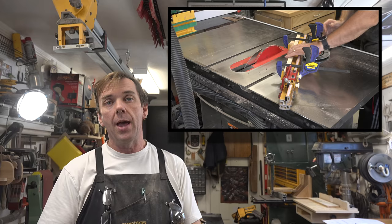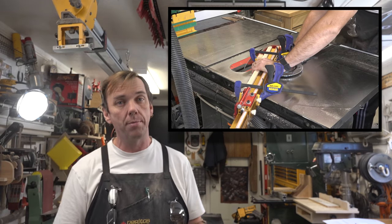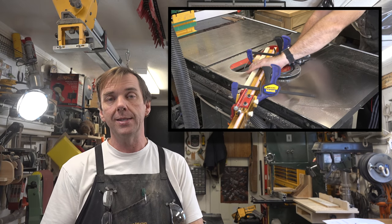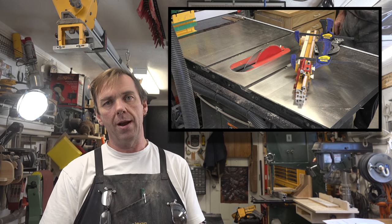Before you can mount these leaf springs, there's one more thing — remember that angle at the back. Earlier I said it wasn't necessary to cut it yet; we'd cut it later to make sure the ends line up evenly. Here it is: we use an angle finder to find which angle to cut because the prints don't show it, but they give you measurements for both ends of that angle so you can measure it. In this case it's a 60-degree cut. Don't attempt to hold this with your hands — get clamps in there for extra pressure and strength.